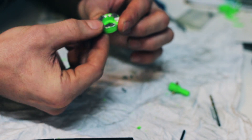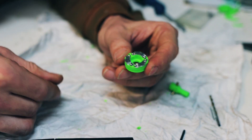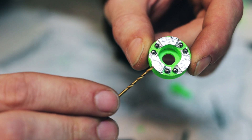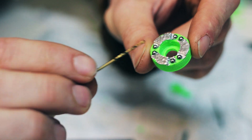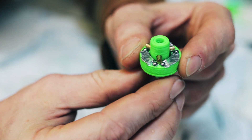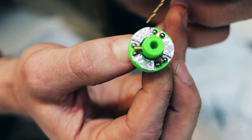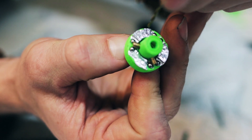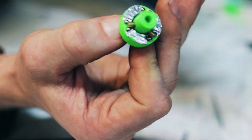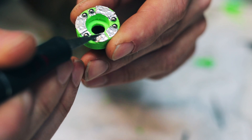Now you put the little balls into the depressions. The foil makes the connection between the balls, and the post goes in the center like that. The center post makes the connection. Right now we've got series connections going all the way around, and I want to put a wire in on one side and a wire in on the other. So I need to break the last piece of foil right in between these two screw holes — just like that. Right here you can see I've broken the connection now.